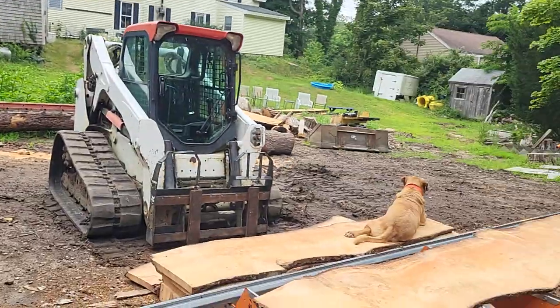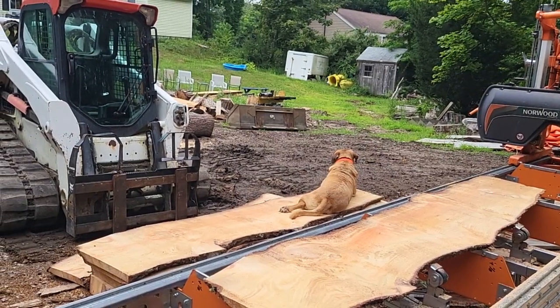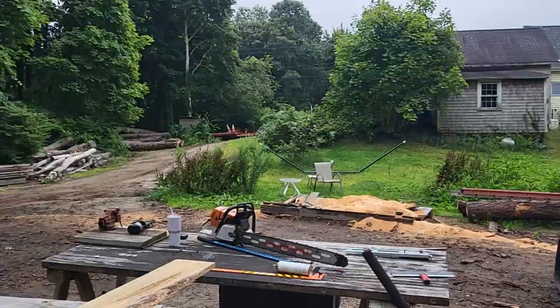If I can bring in $700, $800 a week cash with no problem, then that keeps me happy until the outbuildings are done. I can move some things around and start cutting some stock and selling the stock. For now I've got Danny and myself — appreciate the watch. That band is still humming. We're going to start to get into semantics over the board feet — we're up around 750 board feet right now. It's still cutting laser flat. I'm milling basically full-width passes in pine with a 10-degree band. It's milling perfect. The roller guides, I don't know what to say, man — they're operating terrific. They're great for slabbing versus ceramic guides, which suck for slabbing — my honest opinion. For now, it's Pirate Solutions out.